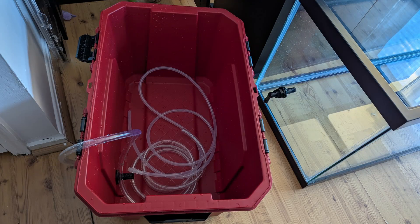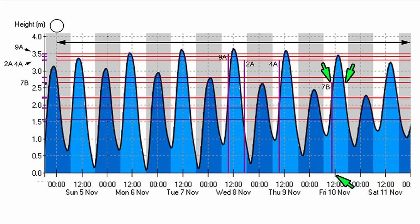I also drilled the hole in this plastic tub, which I'm using as a sump — it holds the extra water during low tide. I want the tides to transition from high to low twice every day, which roughly matches tidal patterns from Malaysia. I've programmed the Arduino to control the pump at certain times of day in order to somewhat match this tidal schedule.